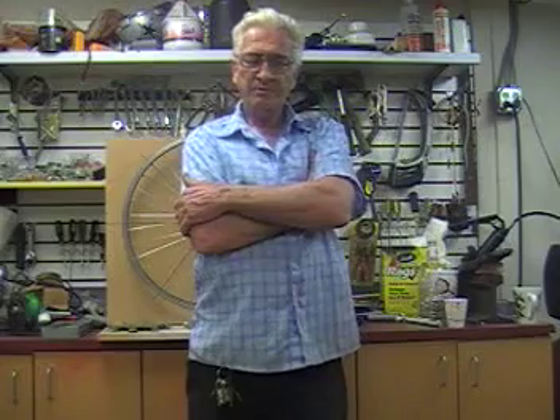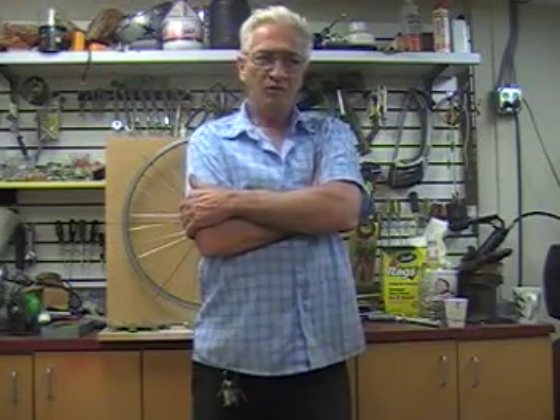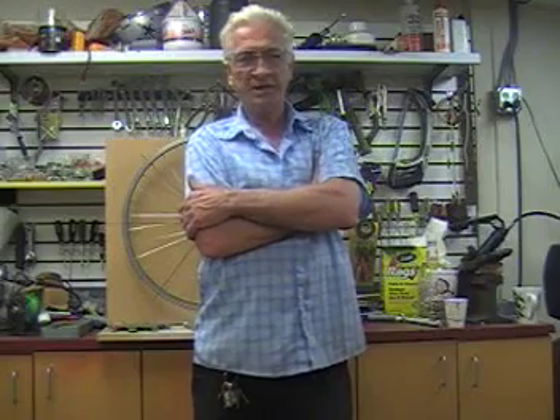If you've been reading the description underneath it, that pendulum was not a two-stage oscillator. It was just a straight pendulum, and I'm working on trying to build an escapement that will run the pendulum with weights. Once I can do that successfully, then I'm going to build a two-stage oscillator using those escapements.